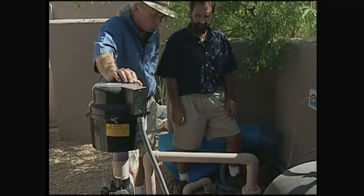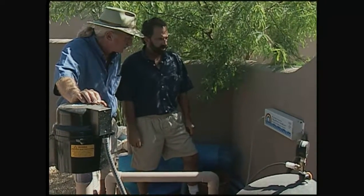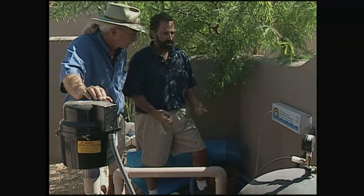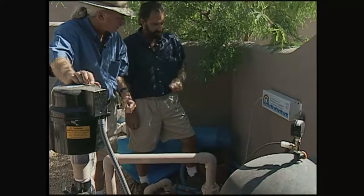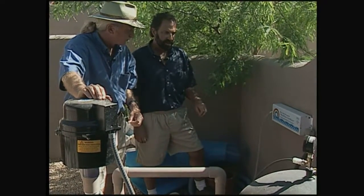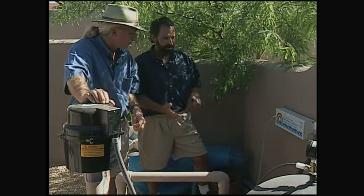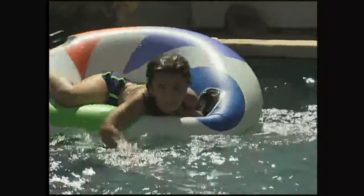You've got a lot of equipment back here, Brad — but this is something I haven't seen before. What's this? This is called an ultra-pure oxidizer — it's a chemical reduction system. It doesn't produce chlorine, but it produces ozone, which kills bacteria. The ozone is a gas that goes through this clear tube, and it's sucked in through the filtration system, reducing the amount of chlorine needed by about 65%. That, in turn, gets rid of the green hair, the red eyes, and you don't really smell the chlorine because you're not using a lot of it. Picking a good water purification system is not only important to the life of your pool — it's essential to the people who swim in it. So again, you can't do too much planning or research.